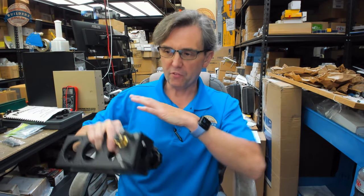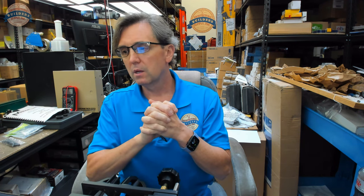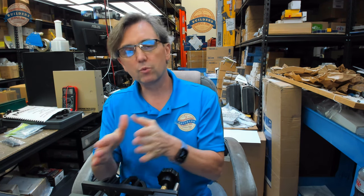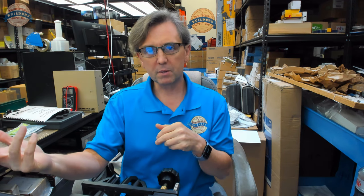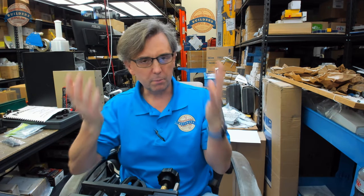Okay, so the bottom line is with this HIT 55, or actually HIT 551, the 551 means it includes stuff not included in the HIT 55. You can drill those 1.5 inch, 2 1/8 inch holes, 2 3/8, 2 3/4, 3 3/4, and 5 inch back sets. This part of the video is we're going to go through, and I'm going to use the installation instructions as just, you know, the bullet points to demonstrate this. Otherwise, I'll be likely jumping all over.